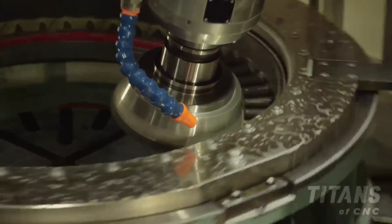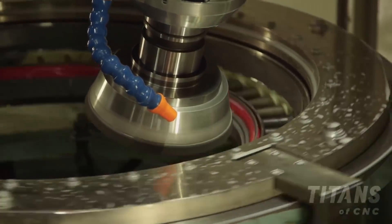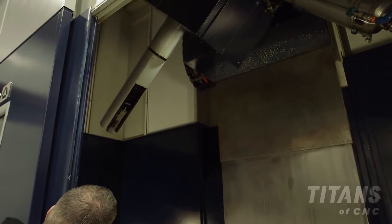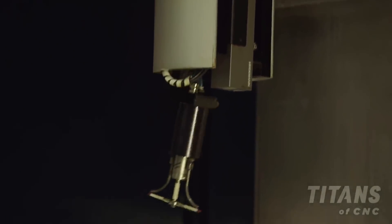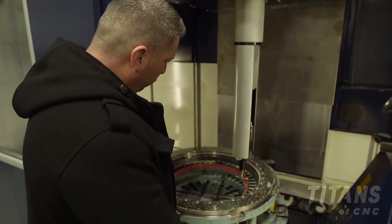It's essentially less efficient — like a regular car engine that's not running right. This has to be absolutely perfect. When it's finished grinding — and you only have a few tenths — how do you inspect it? This is a special machine; there are only a few of these in the world. The CNC controllers move the head out of the way and bring a CMM inspection arm down to check the turbine, just like a touch probe on a regular CNC machine. It's a built-in probing system that comes down and actually inspects the part right in the machine.